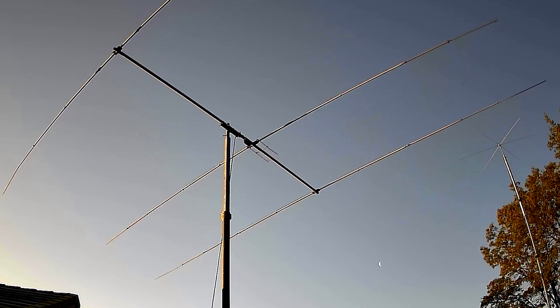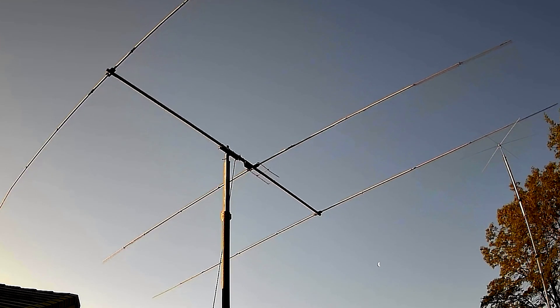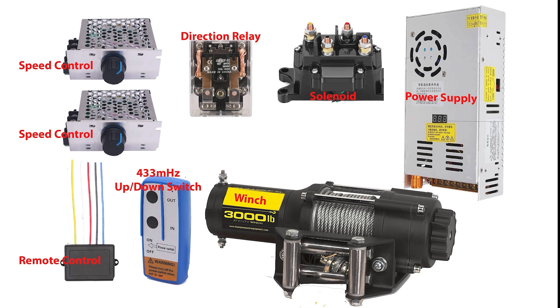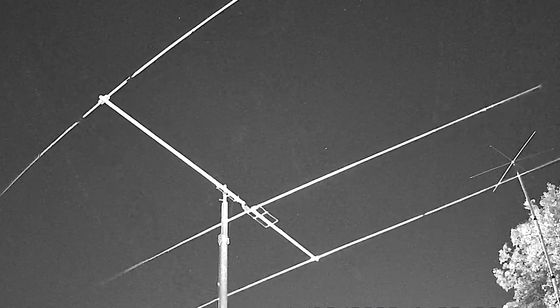As you can see, it's going down now — a lot faster. I'm going to show you a block diagram next of the parts and pieces in a box adjacent to the tower, because it takes a bit of electronics to control the movement up and down. The power supply is in the upper right corner. There's a solenoid to handle the switching currents, which in turn is connected to a relay. The relay picks the direction — whether it's going up or going down — and it takes one of two speed controls attached to the motor. The reason for two speed controls is it takes less voltage going down for the same speed.